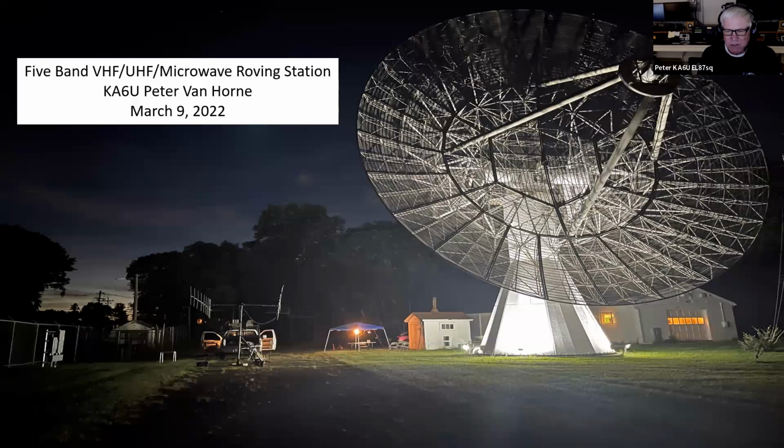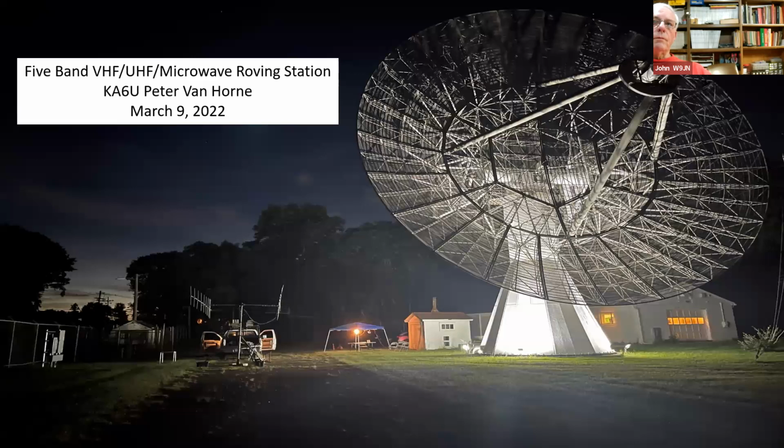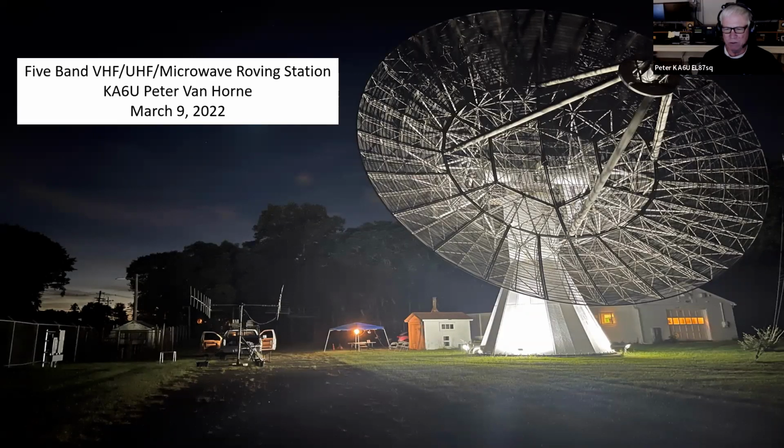Okay, well, thank you very much. My cover picture here is from the Project Diana site, where the first moon bounce operation occurred in 1946. I have some better pictures of this coming up. On September 20th of last year, they opened up the site, and the dish there, a 60 or 70 foot dish that they use for radio astronomy, also has 1296 EME on it. This is at moonrise, and I was running the small antenna setup on the left on 2 meters, while they were running the big antenna on 23 centimeters. So we were both running at the same time.